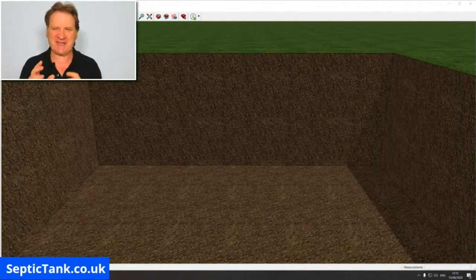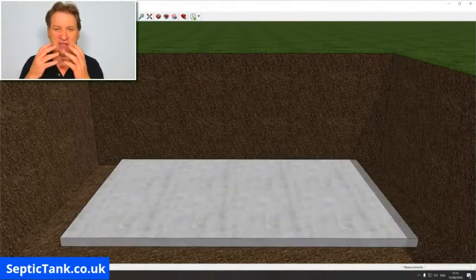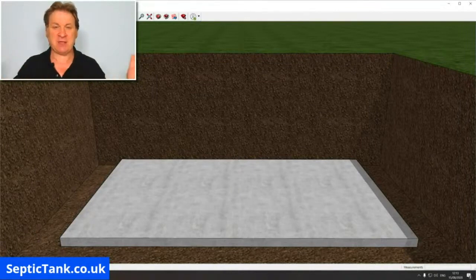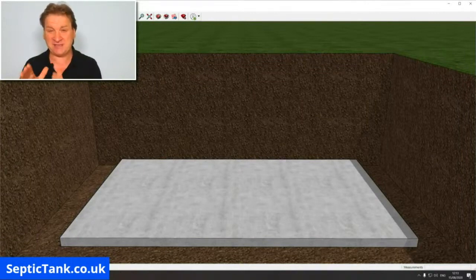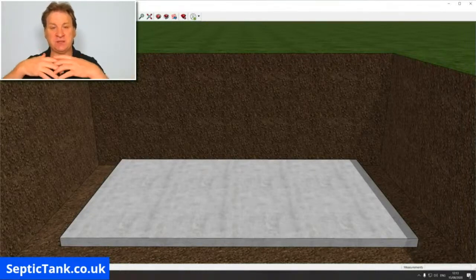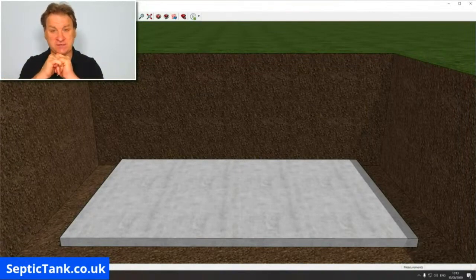The first thing you need to do is create your base plate — a slab of concrete. This could be a template that you pour concrete into, and when it sets you've got your base, or it could be pre-molded. I suggest when you're making it with a template, you use rebar to strengthen it — make sure it's reinforced with steel or some other material.